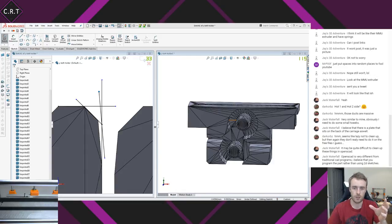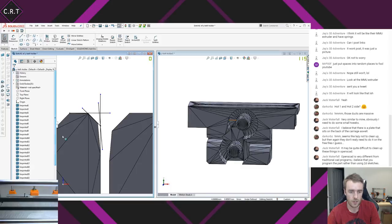And the way that your code runs through it is, again, a bit like SolidWorks. So you have what you call the feature tree. Well, it's not immediately obvious in these imported parts. You basically have an order process. So you start with the first thing, and that might be an extrude of a box. Then the second process is a circle, and then the third process is it cuts it through. And the way OpenSCAD would work is exactly the same as that, only instead of drawing the things and having the tree, the code is the tree, and the code does the operations. Essentially, SolidWorks is probably built on something like SCAD with a nice user interface. So in terms of being able to tidy things up like this, I don't think there's a massive difference. I'm pretty sure it would work in the same way.